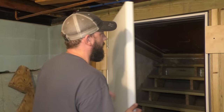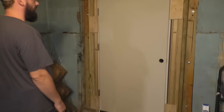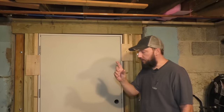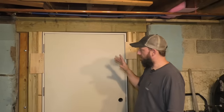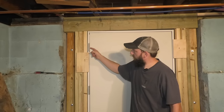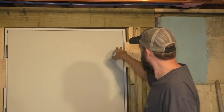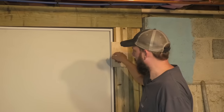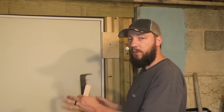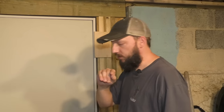Let's see how we did. Awesome — let's secure it. In order to secure this, I'm going to use some long screws, and I'm going to shim everything first. Then I'll open the door up and put the screws in. I put one screw in each hinge that goes into the framing. And then everywhere else where there's not a hinge, I go through the jamb into the framing. As I installed this frame with these pieces, I put everything square and made sure it was going to work. The only thing I did do is down at the bottom — I knew that had a little tiny bit of a hump, so before that glue set I shifted this up, pried it just a little bit, and put a screw in here. I'm going to have to put some shims under here so it stays there, so I don't have a hump that might make the door a little off and trickier to close.